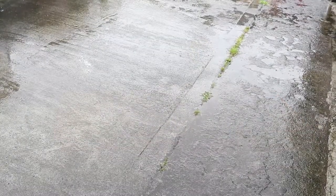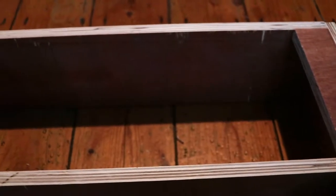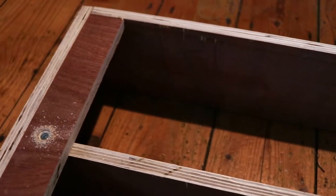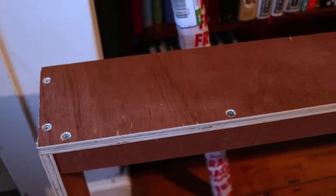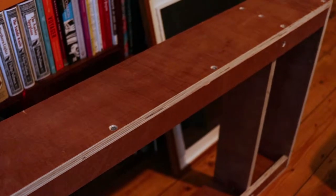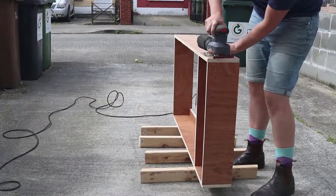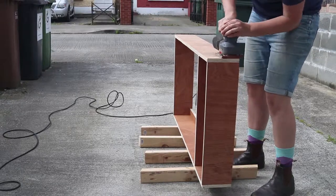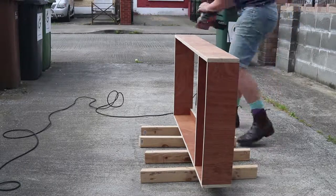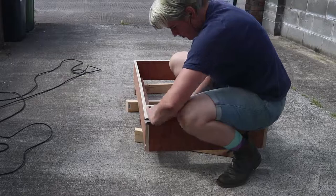Because it was summer in Dublin I had to finish up my cuts and move inside for a while. I glued and screwed the bed sides together and was going to hide the screws with dowels, but changed tactics when I noticed this was holding me up and stopping me from finishing the bed. I used wood filler and sanded it back instead, which doesn't look as good but it got the job done. I used a hand planer to knock back some of the sharper edges.